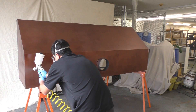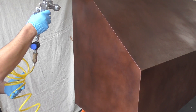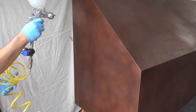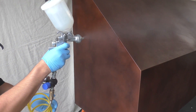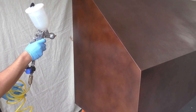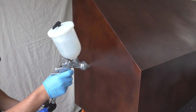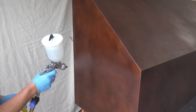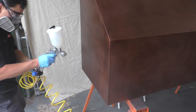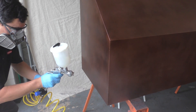We're going to go in with the Everclear mat now. The Everclear mat is our two-part polyurethane and it's the strongest coating we offer. We're going to shoot it with our Iwata HTE3 — you can find these guns on our web store. It's a really nice lacquer gun, good for spraying most of our clears, the Clear Guard and Everclear in particular. It's got a 1.2 tip and I usually shoot it between 18 and 25 pounds of pressure — just enough to get it looking like an aerosol can. That's what you're looking for, and we can get a really nice coating here.